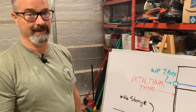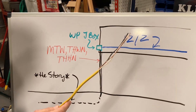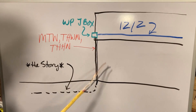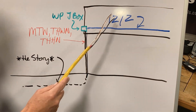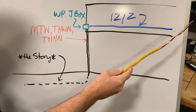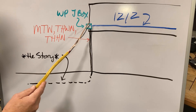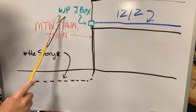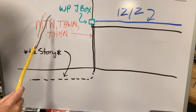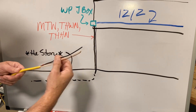Here is a fantastic life-changing diagram. I'm gonna use my classic pointer. Here's a side view of a house — this upper space is of course the attic, a dry location. For instance, we're running 12-2 Romex. We go to the outside, which is now a damp or wet location, so we've got to do a weatherproof j-box. Here was the question several of you asked: if I strip off the sheath and just push these wires through the pipe, is that okay?